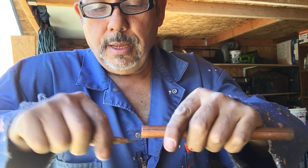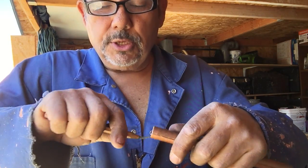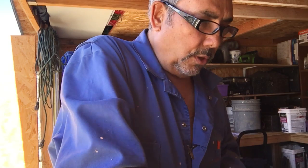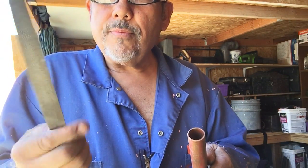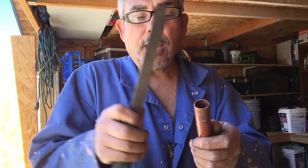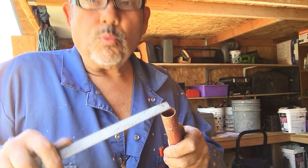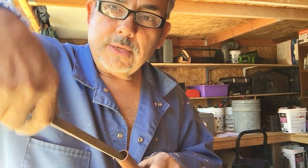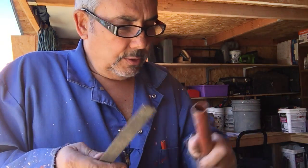There's a tool here — there's another tool they sell to ream it. You can use this; it works very nice, you can put it in your pocket, and every time you cut your copper you just ream it. For larger pipe, use a half-round rasp file on the outside. You don't necessarily need to file the outside unless it's bigger pipe, like one inch or one-and-a-half inch, and then you ream it with the file if need be.